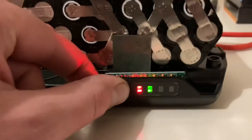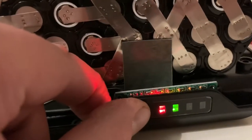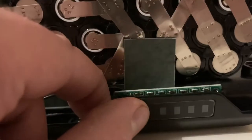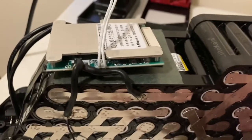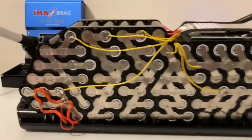Connected the battery meter. So that's permanently connected to the main negative and the main positive. I've done that on purpose because if it was connected to the BMS and the BMS fails, then you'll get nothing on that. But if there's no voltage output, but you know there's battery power, then you know the BMS has failed. So it's a bit of a... I've done it on purpose. Anyway, there we go. Well, that's this side wiring done.